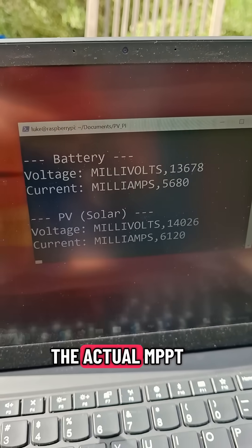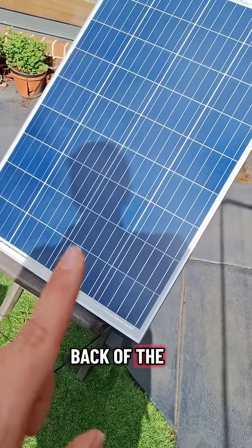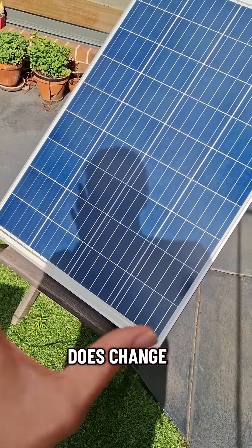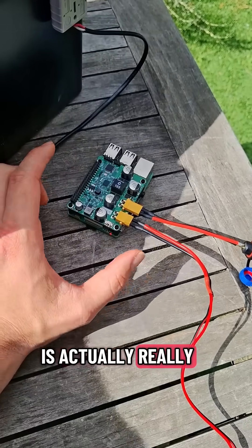In cloudy intermediate weather, the voltage on the solar panel will kind of shift around as it's trying to find that MPPT point. The actual MPPT voltage from your solar panel changes based on light conditions — it's not a fixed value. The value given on the back of the solar panel is usually for optimal conditions, but the voltage that gives you max power does change based on solar conditions. Because this is always trying to find that max power point, this solar charger is actually really quite efficient.